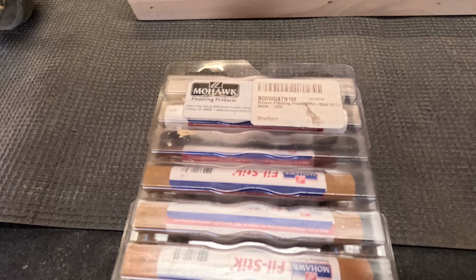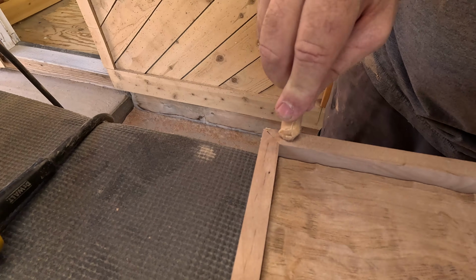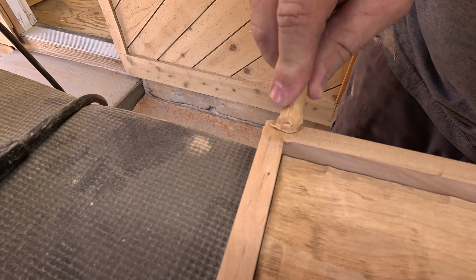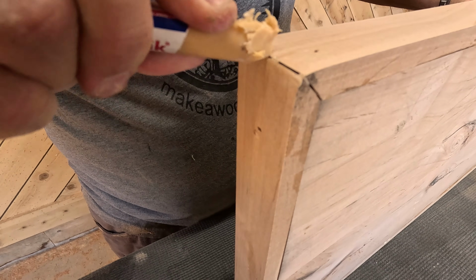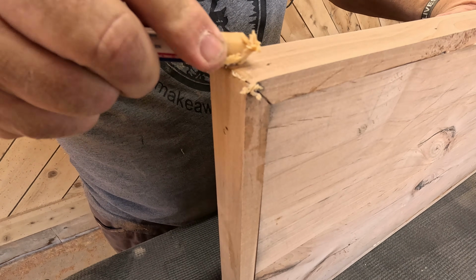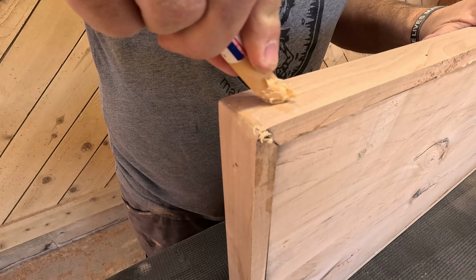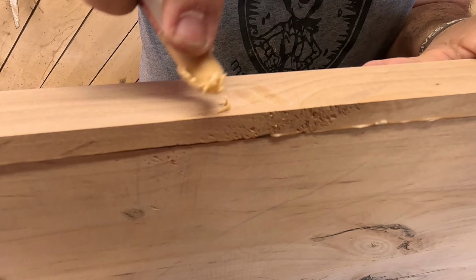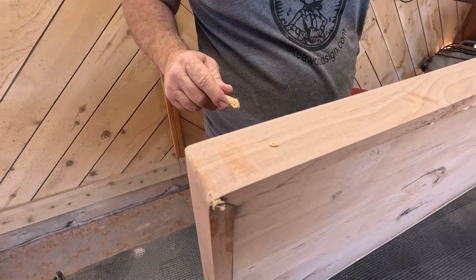Now these things here are amazing. They're called fill sticks. Dad's had them for a few years, so I'll try to put a link below if I can find them. But basically you use them like a color crayon. If there's gaps in your frames, they're just wax sticks that you match to the grain of your board, and then you just color inside the gaps. I was a little skeptical, but Dad was messing around with them the other day, and man, they work great. I was really impressed, not only with how easy it is to fill, but with how well the different colors match.